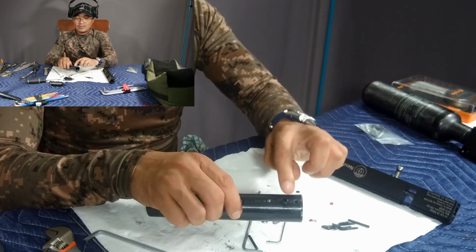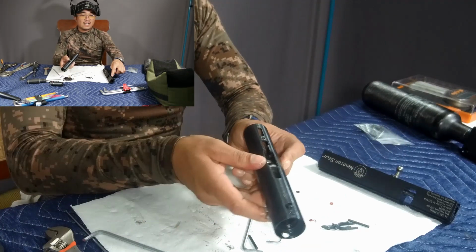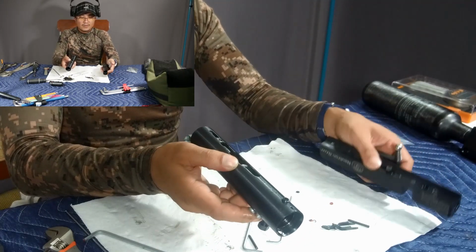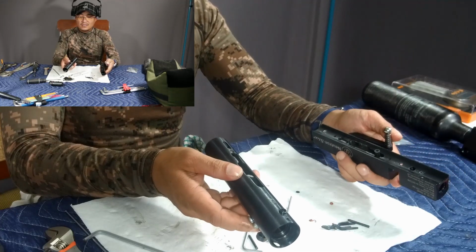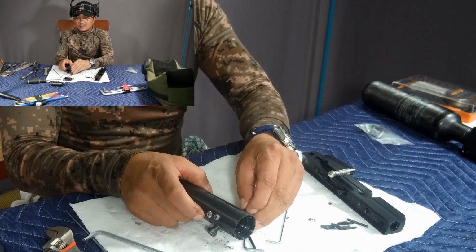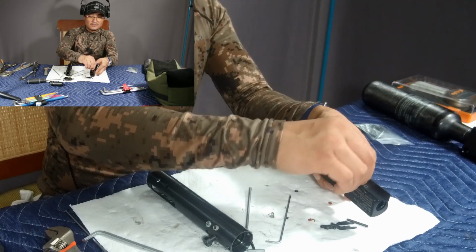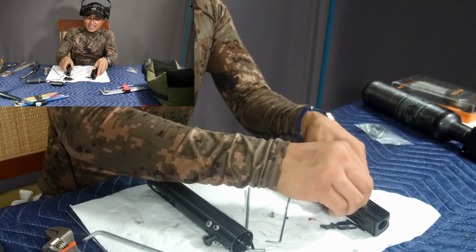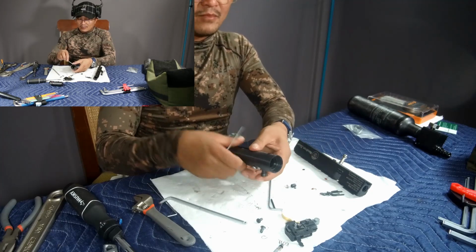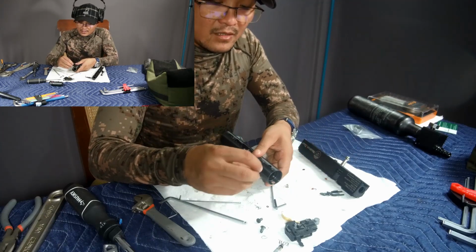With this transfer port that is plastic, it should be in this tube rather than having it here, because it's easier to guide it without more risk of damaging the o-ring if you have it in this spot, like this. Okay, because if you have it like this and now you have to try and guide it into that o-ring that's there, well, you might damage the o-ring. So we just want to make it simple enough for you folks, and make sure that the o-ring doesn't get damaged.